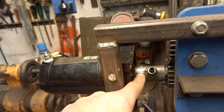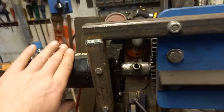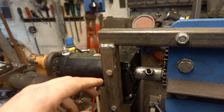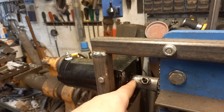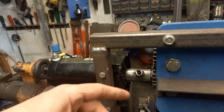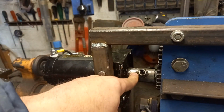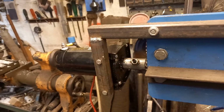Inside here I've simply trimmed down the 12-inch, 12 volt hoist, I should say. When you take them apart, it's pretty obvious what to do. There's a little cog that fits inside there, and that fits inside another cog on the other side, and you can turn that down either on a lathe or rig it up on a drill and just grind it down. And then a bit of inch internal diameter tube, you can slot it in and you can make it so you've got a connection between the two, and that works a treat. Nothing too complicated, quite easy enough to do.